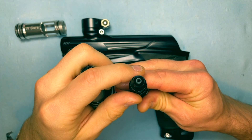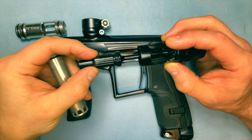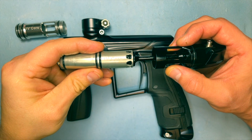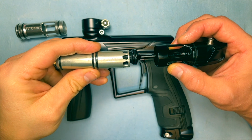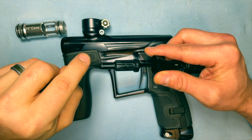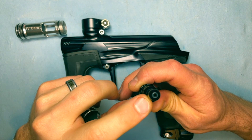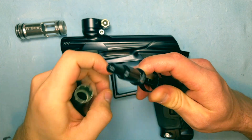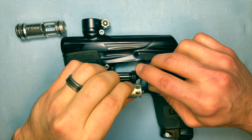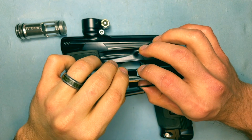At the end of the prop shaft there's a hole that runs all the way through the shaft to the end of the prop shaft. At the end of the bolt cycle, as the bolt goes forward and fires, some of the air going out the front of the bolt is also pushing back through here — equal and opposite reaction. That air goes through this prop shaft hole all the way and shoves the prop shaft in front of the bolt holes, trapping the remaining air from the shot inside the volume chamber.